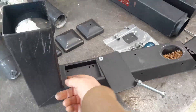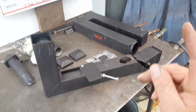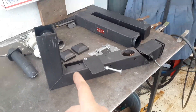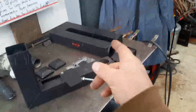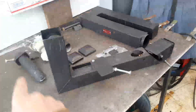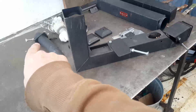That exhaust tube jets out the top. So basically you have your ash drop, your combustor, your combustion rate regulation by induction, your high-temperature hot plate, your room heat exchanger and hot plate, your chimney exhaust, and caps and cleanouts on all the ends. You have your Nomex soft hopper holding over a bag, your flexi tube, your legs, and your feeder with shutoff valve.